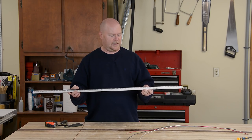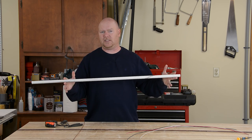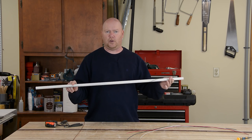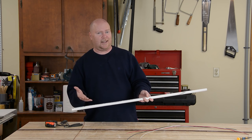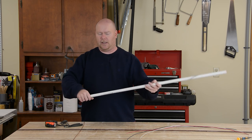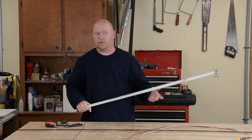The boom for my antenna is this piece of PVC pipe that I have laying around. I only really need about 36 inches or so for the antenna — this is a four foot piece — but I'm going to leave it like this, because in a real emergency situation you might not have something to cut PVC. Practically speaking, I need something to hang on to, so the antenna goes out the front and the rest of it's just going to be a handle.